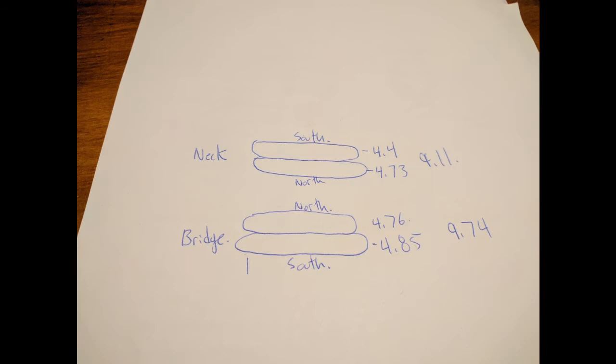To make the single coils — while you'd think you'd want the strongest pickups, the closer you are to the bridge the less string vibration and less output you get. I really wanted the bridge pickup split for a more Telecaster-type sound, so in the end I chose the two weakest coils. The neck pickup should naturally be weaker than the bridge.